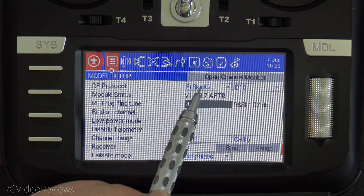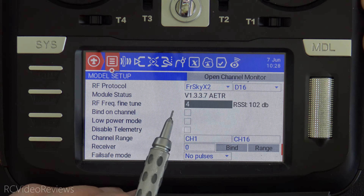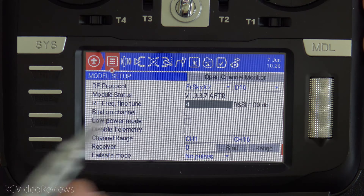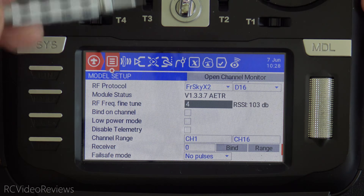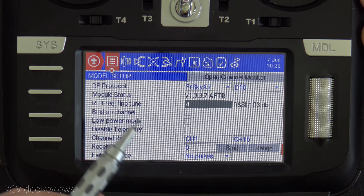With a value of 4, that puts the frequency center point on the MPM for the FrSky X2 protocol at a value of 4 — it slightly moves the center point over just a little bit. That's frequency fine-tuning; that's the dead center for FrSky X2 on this particular MPM. For my radio the fine-tune value is 4, but yours might be slightly different. That's the very nature of frequency fine-tuning — it accommodates hardware variants in the multi-protocol module. Just follow the procedure and you'll be okay.